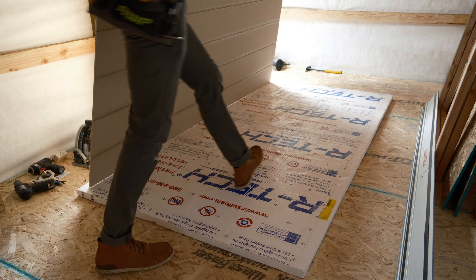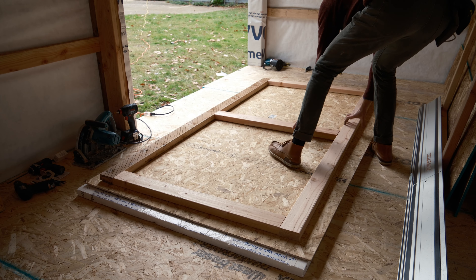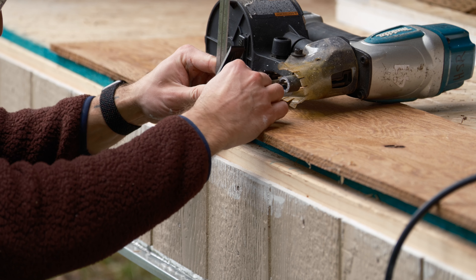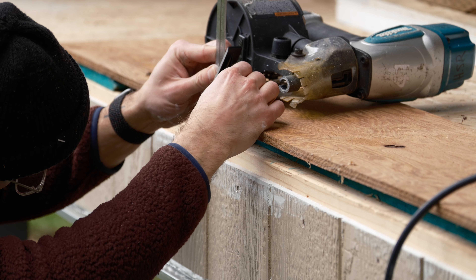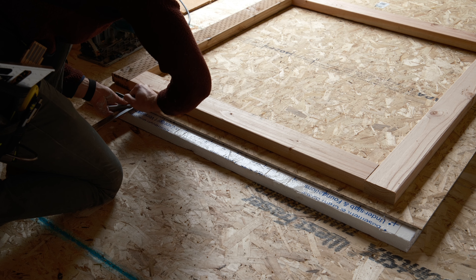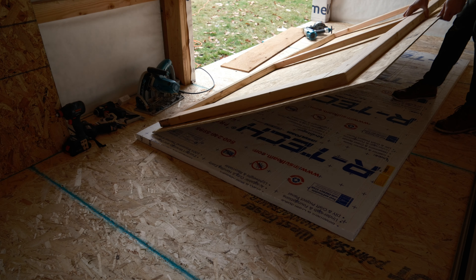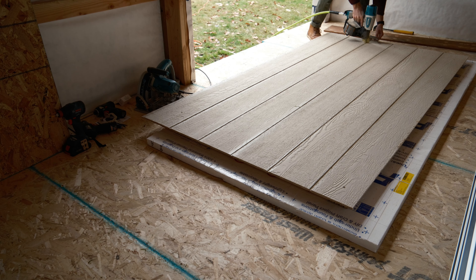The trickiest part of making this door was probably getting the siding panel attached in the appropriate place so that all of the gaps would end up where I wanted them to be. To get this right, I laid down a piece of plywood on my door threshold equal to the gap I wanted between the frame and the floor. Then I just slid my adjustable square down to find the gap, and used that measurement to position my door frame to the back side of the panel. Then I tacked the frame to the outside panel with some screws, flipped the whole thing over, and used some siding nails to make the final attachment.